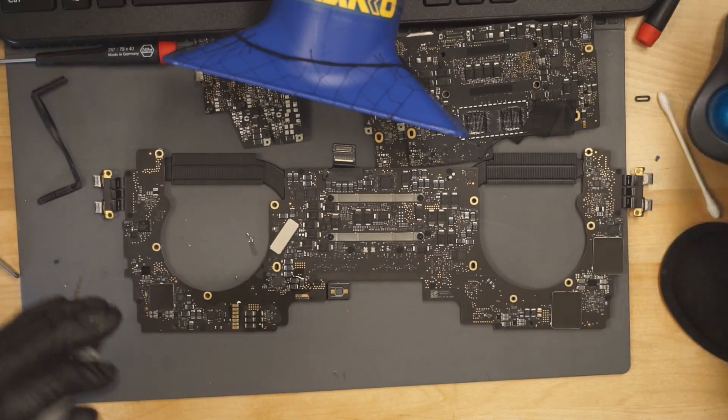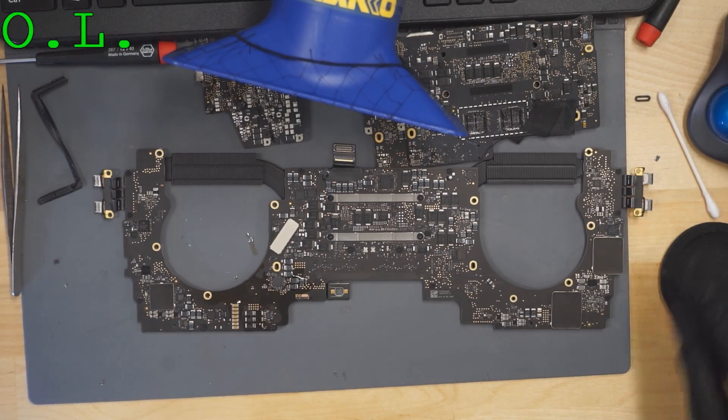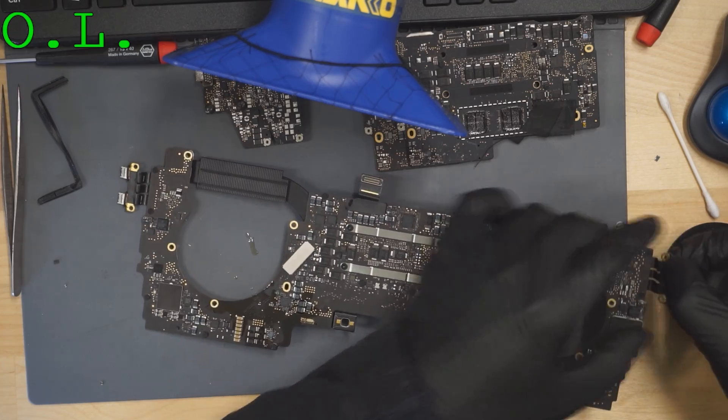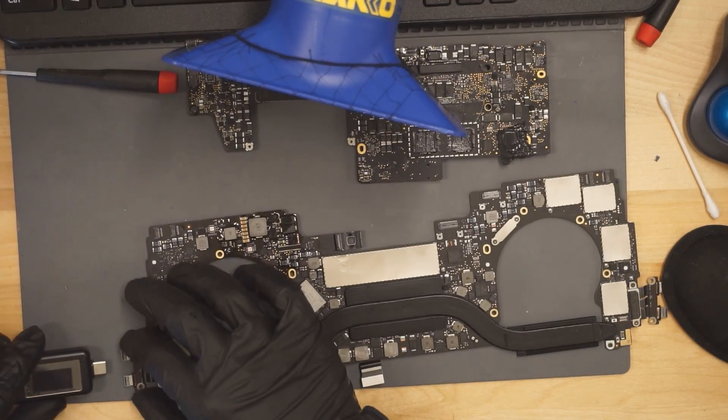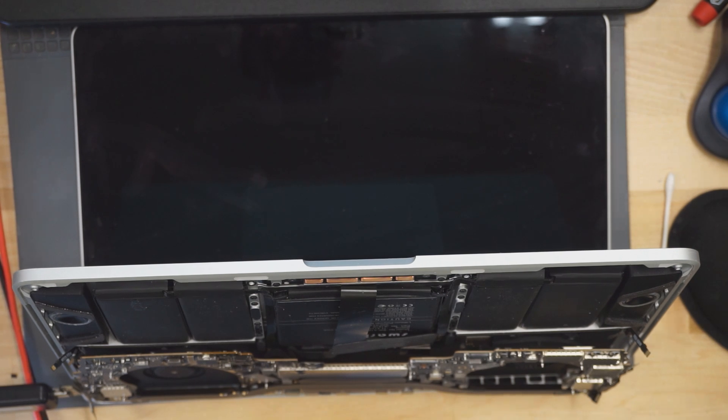Let's make sure our short circuit is gone. Paul Daniels' software shows us that the short circuit is gone. Now let's see if this board will turn on and work. 20 volts! Let's see if we get an image on the screen. Apple logo — it works! PP3V3_G3Hot is present, the diode is working, the shorted capacitors have been removed, the ISL9239 that was keeping our enable from working has been replaced, and it works. We have fixed another MacBook board.